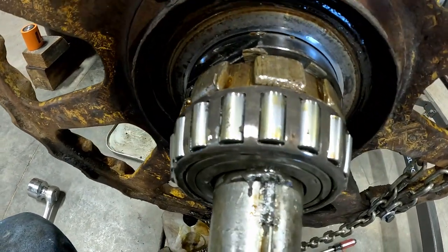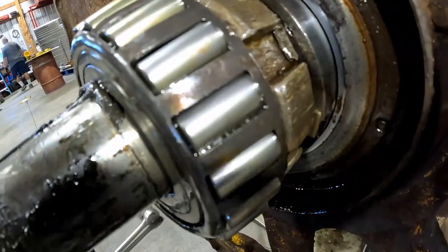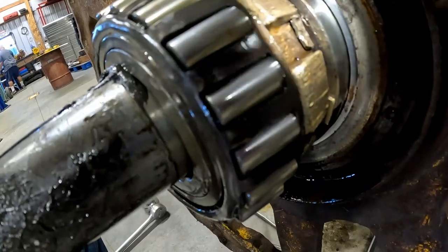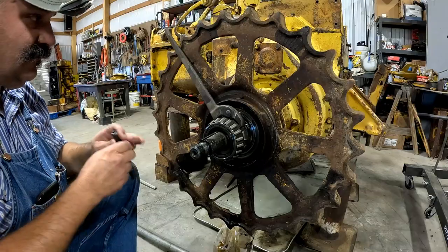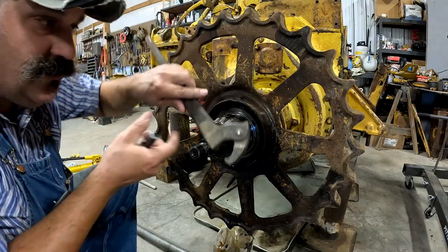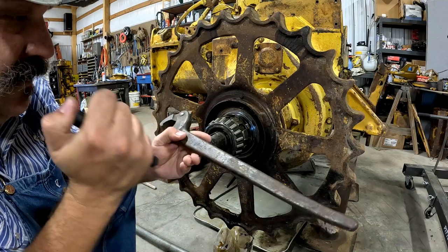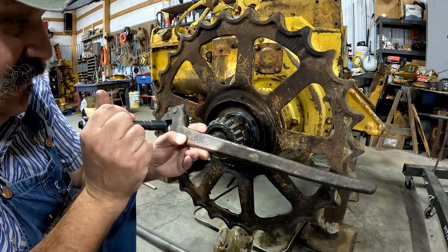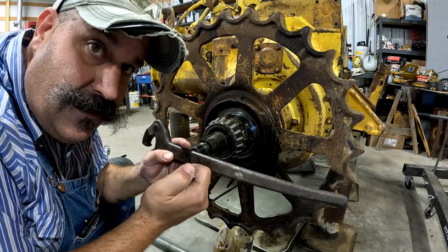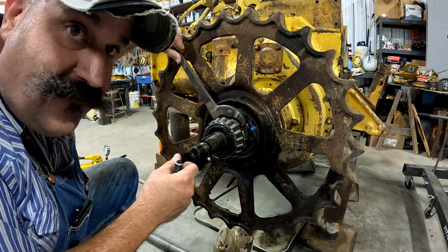You can see that fold-over lock has been folded several times. We're going to unscrew that nut and push this bearing off. Looks like right there is where it's folded over in the nut. Actually found another spanner wrench that works a lot better on here — I don't know where this one came from. It might have been in my grandfather's toolbox, but on here it says UPRR, which I'm guessing might be the Union Pacific Railroad. Nevertheless, works perfect for a D4.